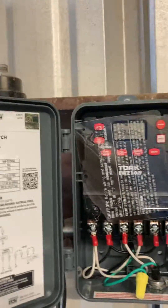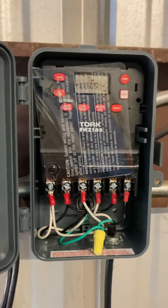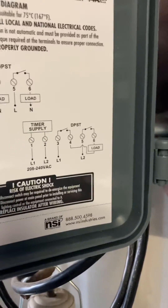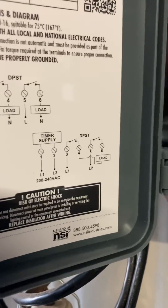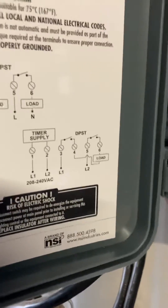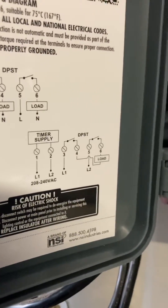I'm just going to do this quick video here on the Torque EWZ-103 digital time switch. Based on the diagram right here, this is wiring for 240. There are videos about how to wire 120, but I couldn't find anything for 240. But I made the mistake of jumping 4 and 6 together, and it wouldn't work. So I reached out to an electrician friend, and this is how you set it up.